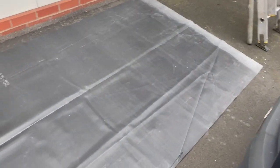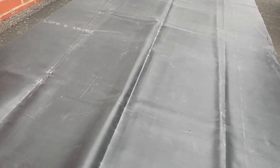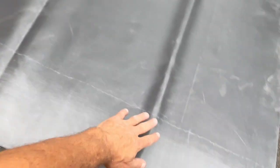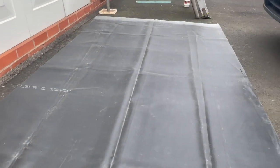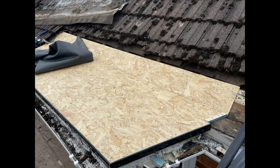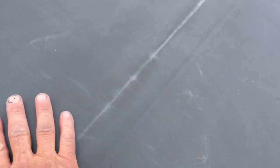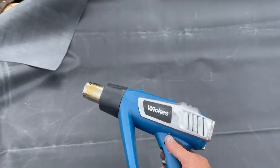The rubber is laid out here on the driveway — it's been there for about an hour and it's still got creases in it. In nice hot weather these creases will probably come out on their own. What I'm going to have to do is get it up on the roof and then use the heat gun to get rid of some of these creases so it lays flat once I glue it. Once your boards are down, put your rubber down for about half an hour. In nice weather the creases should mostly come out; if not, the heat gun is your option — just heat up where the creases are and it will relax flat.